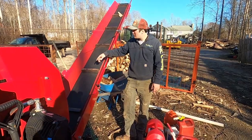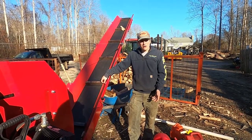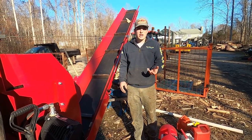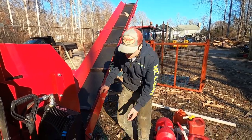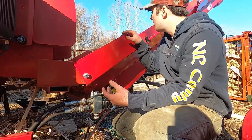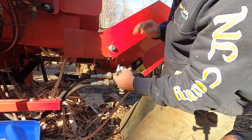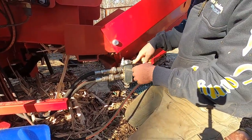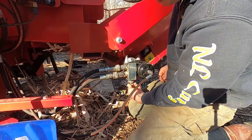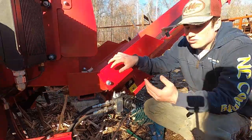With the 14-foot conveyor I noticed the conveyor speed was super fast and I didn't like it, so I called Bob at Metz's. He said he had a little module that bolts right onto the motor of the conveyor to adjust the speed. After about 10 hours on the machine I knew that conveyor speed wasn't going to work, so I bought the speed adjuster. You take the two quick connects off the motor, this silver block bolts right on, and you can dial it from super slow up to the factory speed with no resistance.